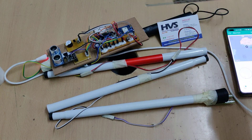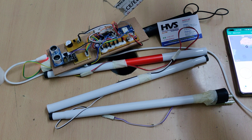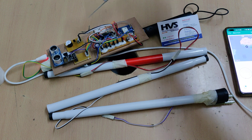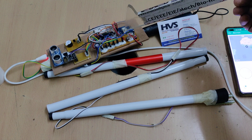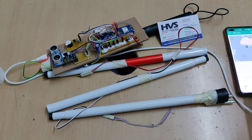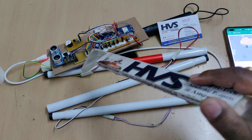These two sensors interface to the Arduino Nano, which processes the sensor data and provides a digital output to the buzzer. It also reads input from the Global Positioning System — the GPS — and the same location data is sent to the Blynk application through the ESP8266 module.